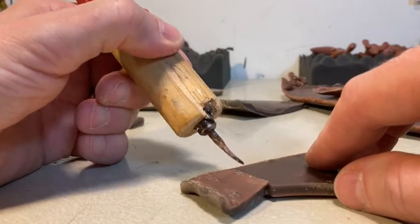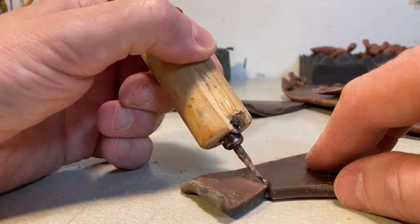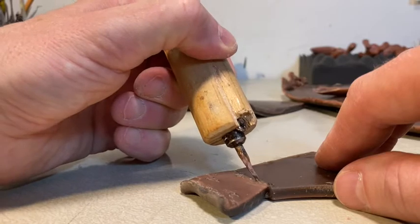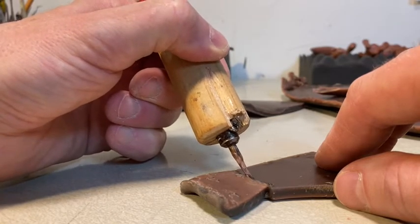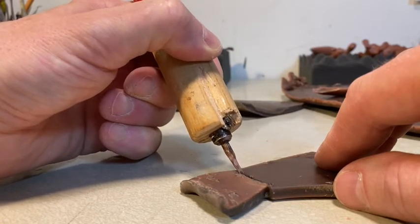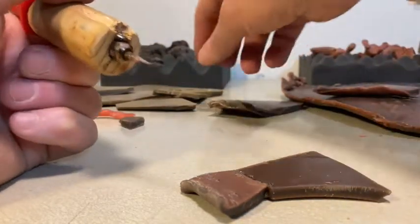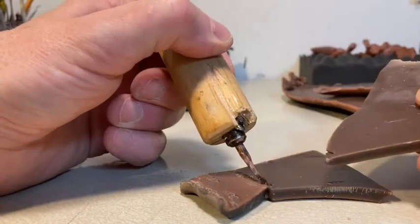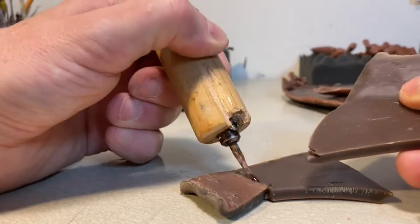Maybe a little bit from the other side. This is rather large so you can see better, but if you're doing smaller things it's more delicate. If I do a lot of this, that weld area is really soft for a long period of time. So I want to let this side cool. I can also bring in and take some off and fill that in, build it up a little bit or fill in the divot. I can scoop a little bit off and drip it back in.